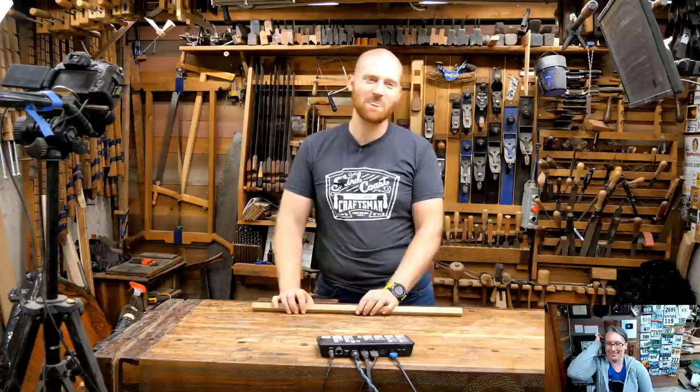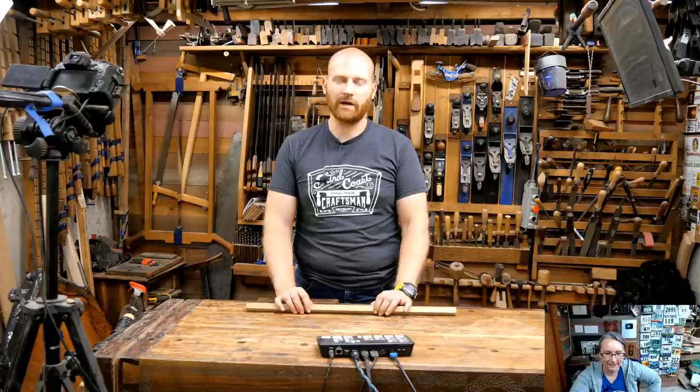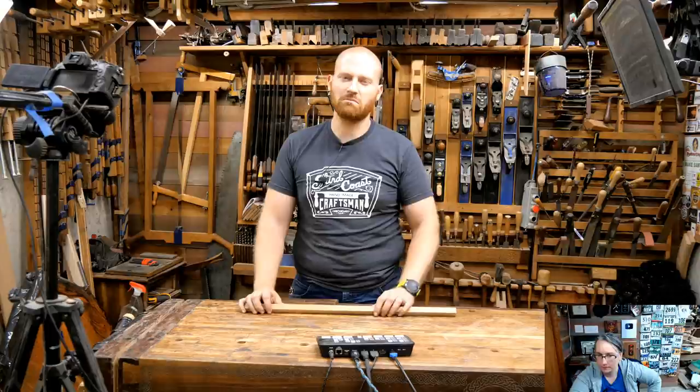Anyways, poor man. Okay, so I've got to give the backstory to this question. Harold had a question about old hand saws being dry and cracked, and you were talking about fixing them. Poor man was asking, is there a special way just for collectibles? No, if it's collectible, you want to do as little as possible. Usually mild soap and a very light amount of water with a little bit of scrubbing from a rag is about all you want to do. Just get the dirt off. You generally don't want to do anything to anything that's particularly collectible. But if you're working on a saw that's collectible, most of the time you know what it is. With any collectible tool where you want to keep the collector's value, you do as little to it as possible. It's just dirt removal and that's about it.